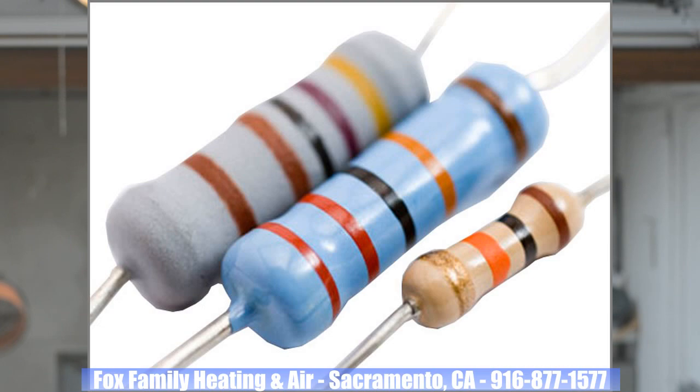Transistors are often the victim of static shock to a control board, but pins, brittle solder, and the silicon itself can be deformed by the heat that travels through during a static discharge. Damage like this can make a control for the blower motor, which is supposed to be off at a given time, a blower that's always on, or a safety switch that's normally closed become constantly open. These parts of the furnace that are needed to work in a certain order can be thrown out of whack very quickly with the slightest arc from your body to the control board.